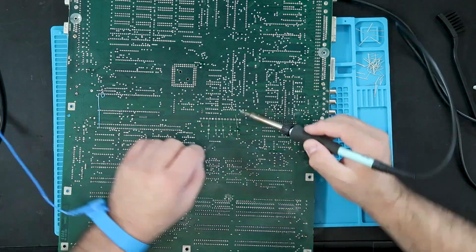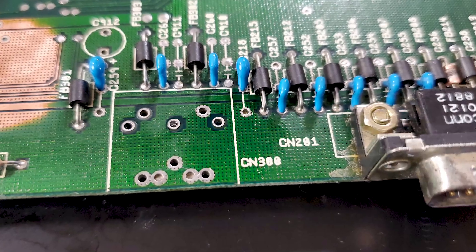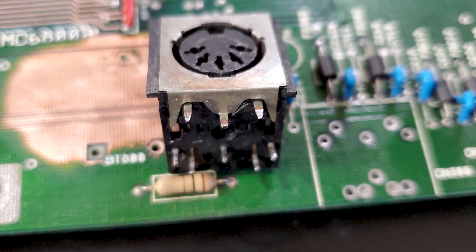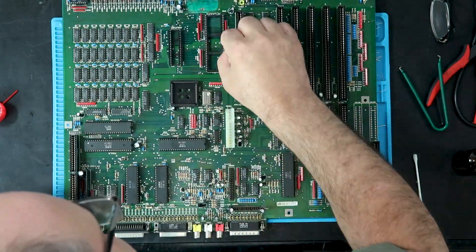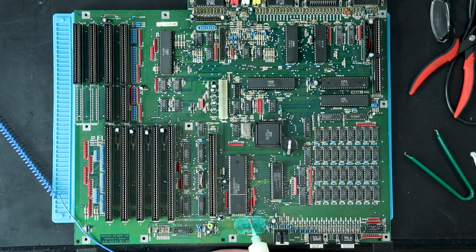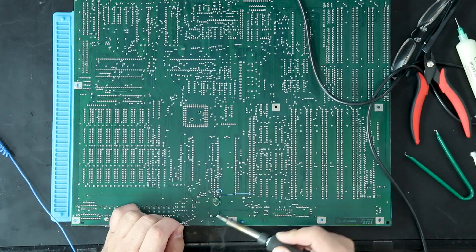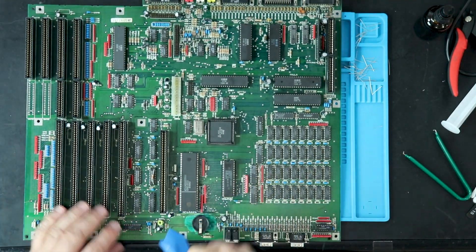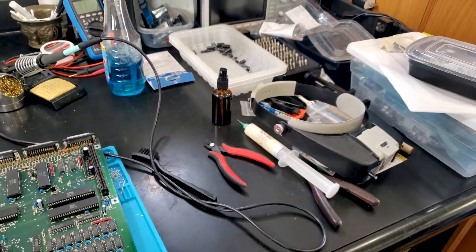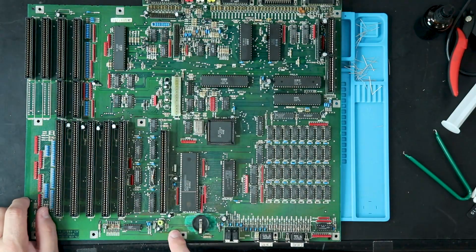Next, all the capacitors need to be installed — each one is placed being very careful to make sure the right values and polarity are observed. The keyboard connector also needed to be removed and cleaned; it had a little corrosion but thankfully it was minor and cleaned up easily, so back on it went. Before testing the board, I removed each socketed IC and cleaned the socket with alcohol, followed by a light coat of DeoxIT D5 with a cotton swab. It's also time to solder in a replacement battery — a coin cell holder with a built-in diode to prevent the Amiga from trying to charge the non-rechargeable battery. The replacement CR2032 cell should last for several years, and if it dies it's just keeping the date and time, so no big deal. One quick final once-over, and it's time for the moment of truth.